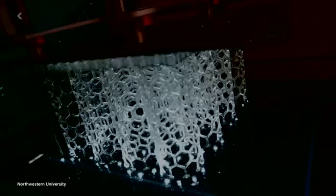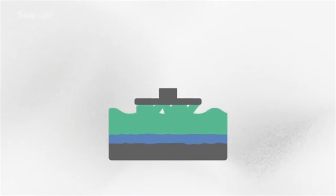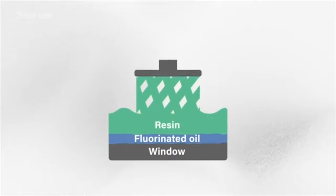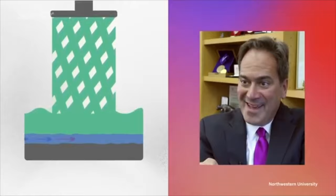This specialized 3D printer just received a record-breaking throughput for modern 3D printing. It can create structures the size of a human adult in just a few hours — printing about 7 millimeters per minute. We have a liquid, think of it as liquid Teflon, that flows over the glass window that the light is shining through to generate the part. That nonstick liquid keeps the part from adhering to the window, allowing continuous printing which gives you speed, and it removes the heat as it's generated. So we're almost unlimited in terms of size in principle.